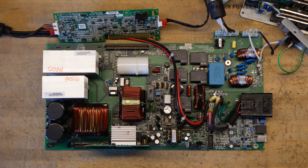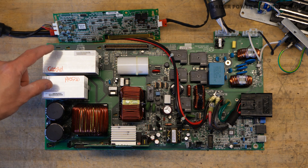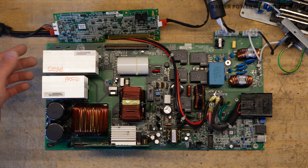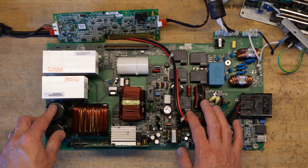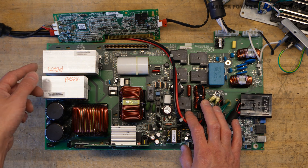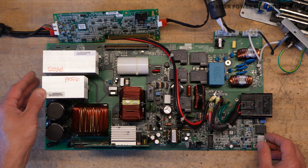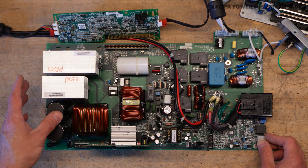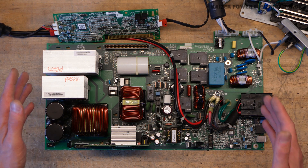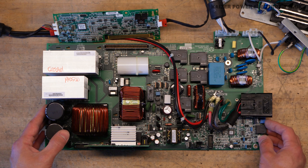We have our DC bus sitting over here, rated at 450 volt DC, 680 microfarads. We have two noise filter inductors and two separate bridges — probably one for battery charging and one for the output inverter. Or it could be one of the proprietary topologies APC has developed, where it can freewheel on the bridge and use the internal diodes for battery charging. Quite exciting stuff I only recently learned about doing other APC teardowns — please share any knowledge you have in the comments.